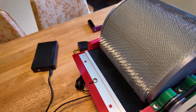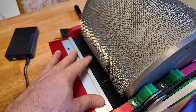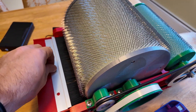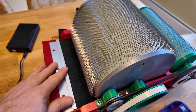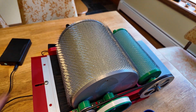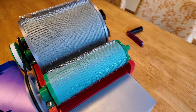Right now I have the brush in the back. This is something I'm going to be testing out a lot more in the future, but you can just sort of slide it backwards and forwards, and then you tighten it with this screw here. I'm probably going to change that to a dial in a future update, but right now you just use a screwdriver to tighten that screw and it'll hold it in place. I found that this actually works a lot better than some of the other drum carders I've used, which have the flexible arm, because you can really push it in there and it helps compress the fiber.